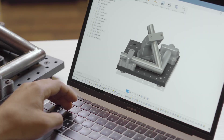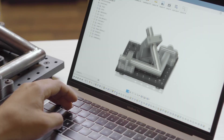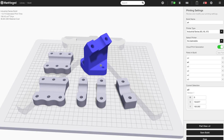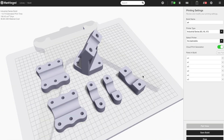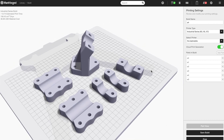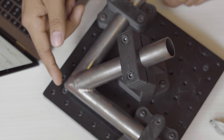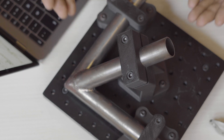Now, let's take a look at an example. These tubes were held in place exactly where they need to be, which would be tricky to do with regular clamps. Our welding fixture was created with six parts total, 3D printed at once in a single job with integrated hardware. The steel tubes were tack welded in place and can now be transported so they can be welded to a larger assembly. With foresight, complex geometry, and low volumes, 3D printing custom fixtures makes it easier for you to complete welding jobs more accurately, quickly, and consistently. Thank you.